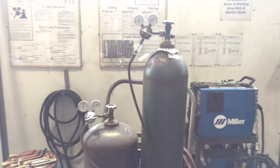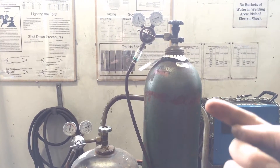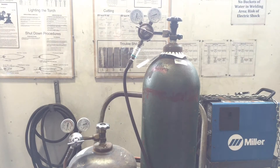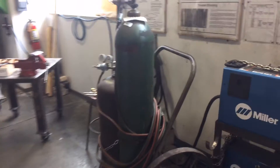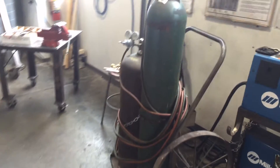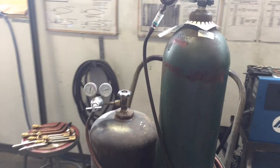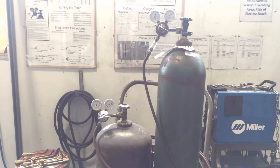The oxygen cylinder is a high pressure cylinder, so you're going to want to be really careful around that valve. If you're rolling this thing around the shop, we do have it on this handy cart here — do that really carefully. Always make sure that it is chained up securely before you go attempting to move it, and you'll want to have it shut down before you start moving it too.